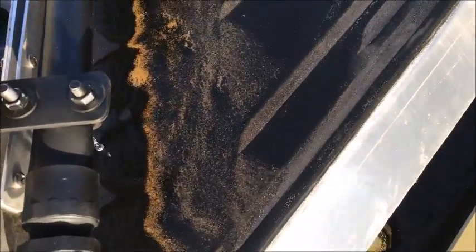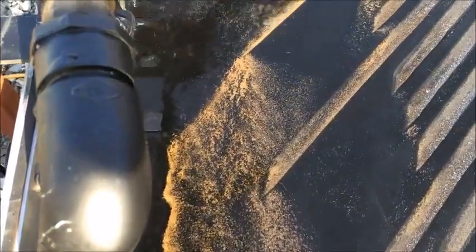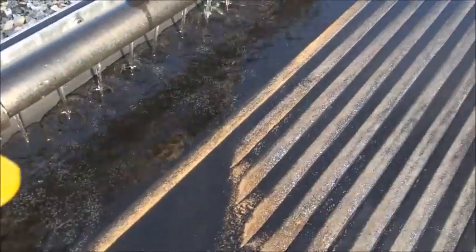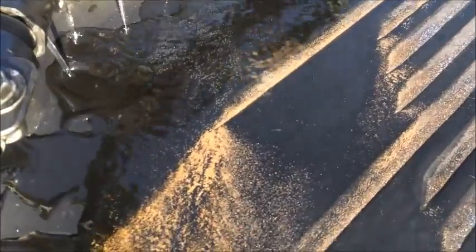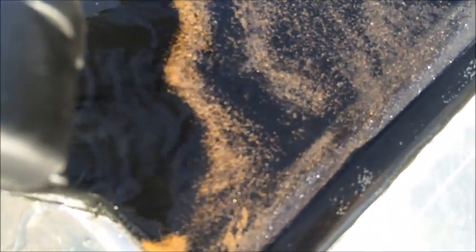We've stopped the table and you can see the separations again. Lots of nice gold on the far left of the table, coming out of the top groove. And then as it comes across the top, the lower specific gravity material gets flushed down the table to the right. And the gold gets transported over to the left right under the water bar. The table keeps trying to push the gold to the left and the water keeps trying to push the gold to the right, so it all concentrates right there in a line.